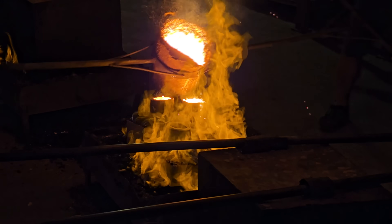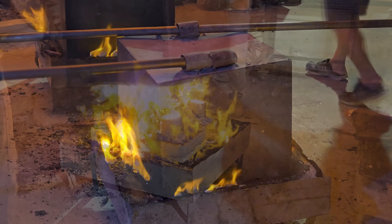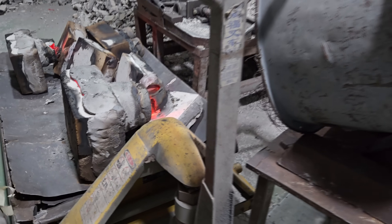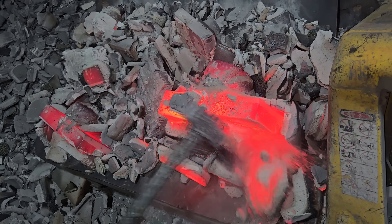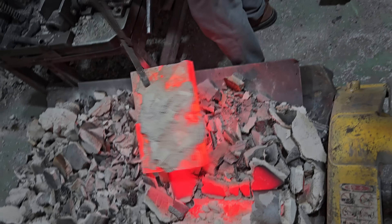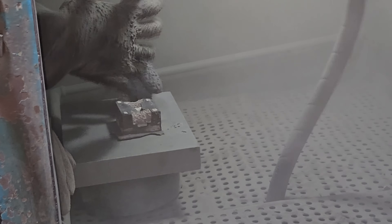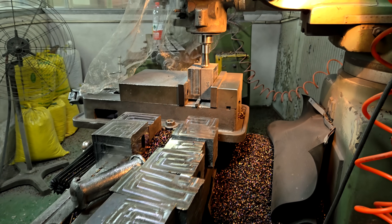After the liquid steel has been poured into the ceramic, things are covered up and allowed to cool — the covers reduce oxidation. Once the metal has solidified, things are cooled a bit faster with a big fan. A few hours after casting, sledgehammers are used to bust open the ceramic and expose the solid but still red hot metal. There's still a lot of ceramic material that needs to be removed and blasted out of the cavities. At first the outer edges of the steel blocks look rough, but with some milling they clean up nicely.